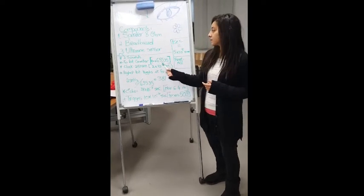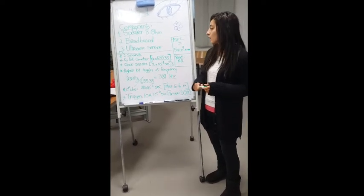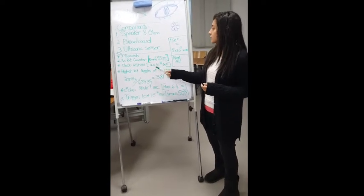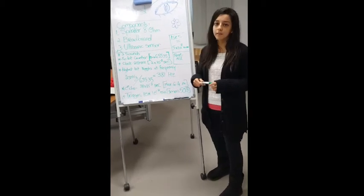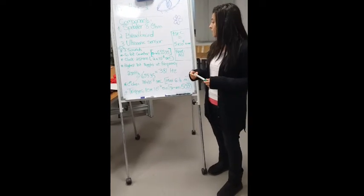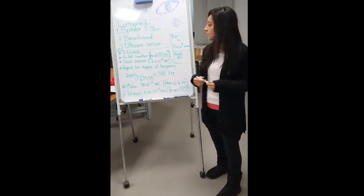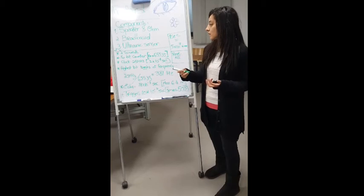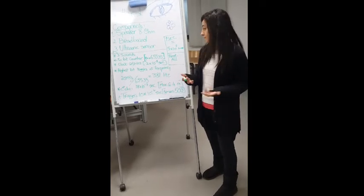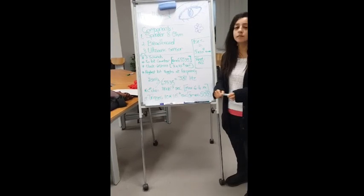What we use is a 16-bit counter. It counts from 0 until 65535, and we use a clock of frequency 25 megahertz. The idea is that every 2 times 10 power negative 8 seconds, the counter is decremented until it reaches 0. When it reaches 0, the result the program got is put in an if condition. If the distance is included in the range that we want, it produces the sound, and the sound is toggled, which makes it go from 0 to 1. If it's not, then nothing new happens. So the highest bit toggles at a frequency of 381 Hz.